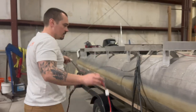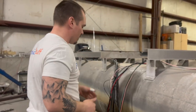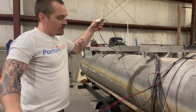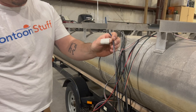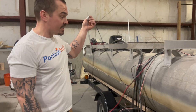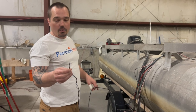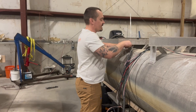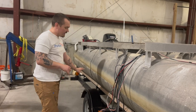If we come back, that plug stays where the console is going to be in between these cross members. And then I have a lead of wires that goes to the back of the boat. Starting with the shortest is a gray with a blue stripe and a black ground wire — that is for my anchor light, my stern light. It's going to go up in this case to a bimini. If you need to extend it farther, you could splice in and run a red and black or the same color wire to the back of the boat. In this case it's going to get tied into the bimini and run back a little bit farther, so we're just going to run it through a couple of cross members and leave it hang.